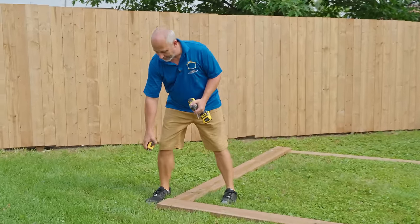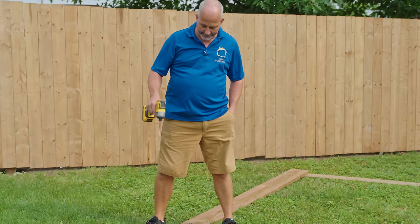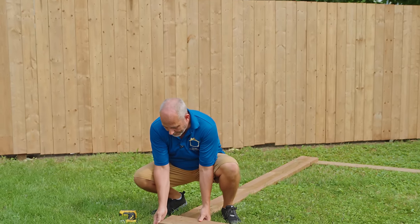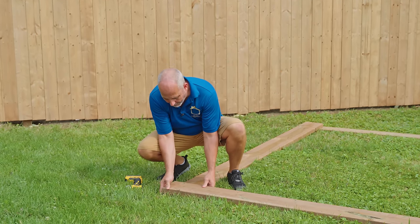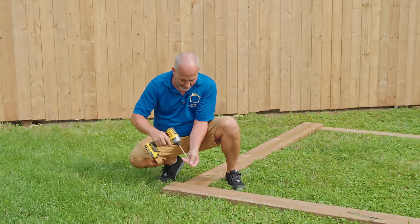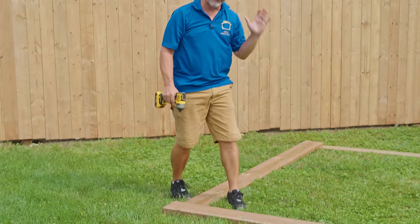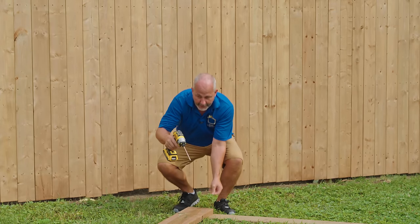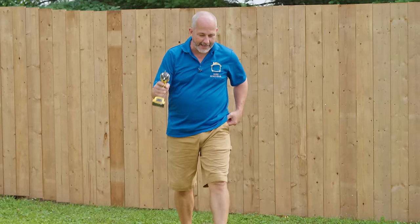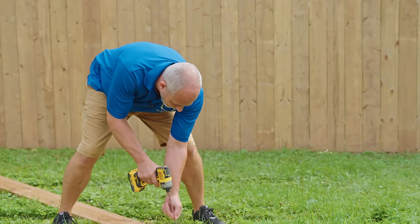Just to make my life simple, because 10 by 16 is an actual dimension, I've got a 2x8 by 10 foot so I'm just taking the boards and squaring them off. I'll throw in a single screw in all four corners. Now this doesn't have to be exactly perfect — the system we're going to use today is really easy. We're going to be putting a block in a location here with a one-foot overhang, same on the other end, same on the back.